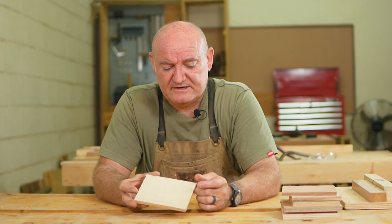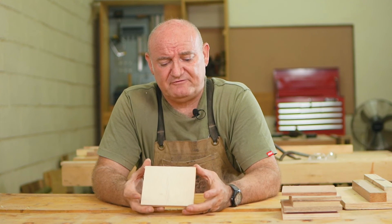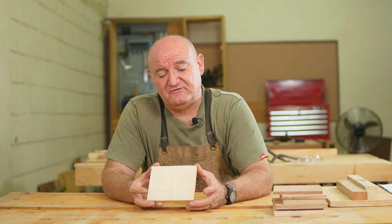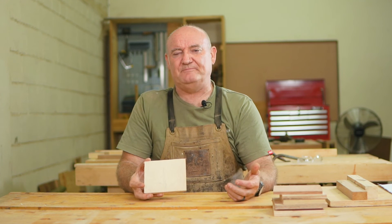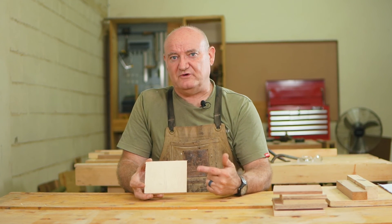Last one here — this is called lightwood. It's called lightwood because it is light. It actually weighs a lot less than you might think. It's made out of a very very light wood but very heavily compacted, and its strength to weight ratio is off the charts good. This is a product where the application is where you need to worry about weight. If you're doing big doors with panels and you don't want the door to weigh so much that it tears the hinges out of the carcass, this is something to consider. It's lightweight, very solid, very stable, and behaves quite well.